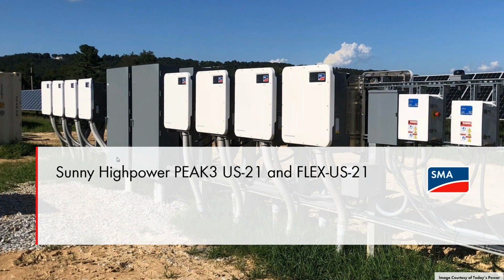It's not really an SMA provided part, but anyone who has that desire, feel free to reach out to me or anyone else at SMA. We have a dimensional drawing for a sheet metal shroud that can be constructed and would attach to the body of the inverter. Again, this is like physical touch protection. You're bending sheet metal, so I don't believe it's sealed fully, but it would certainly prevent a rat or any type of rodent from accessing those connectors and would allow then connection of conduit to it. So definitely that is available for the Core 1 and we can provide it immediately.